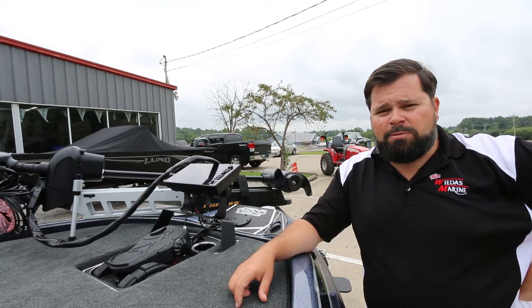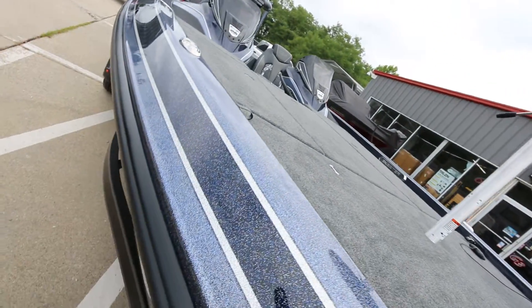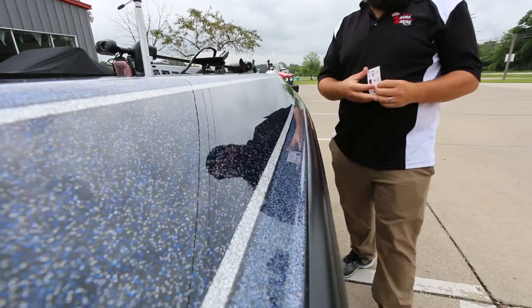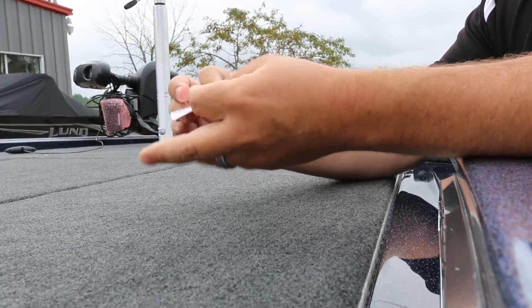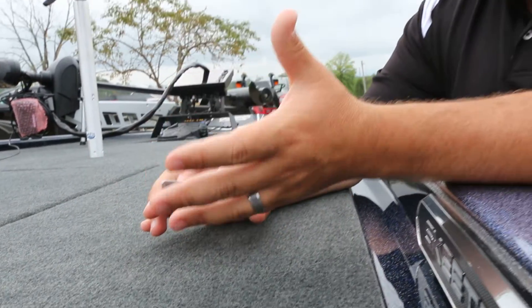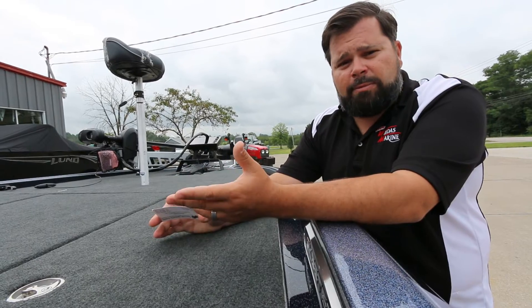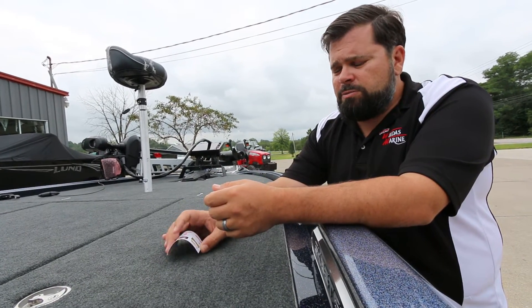Other than the new colors, you can expect the same great features these boats have offered the last couple of years — that super wide deck and the constant curvature principle. What we mean by that is this boat curves from the front to the back and curves from the top of the gunnel to the bottom of the hull. You may ask why that's important — it's the simple engineering principle of an arch. This business card is flimsy and floppy with no rigidity, but if I put an arch in it, it now has rigidity. That is why a Skeeter is one of the stronger hulls — very impact resistant. A lot of these boats are running timbered waters; constant curvature keeps the boat stronger and you're going to have less stress cracks over time.